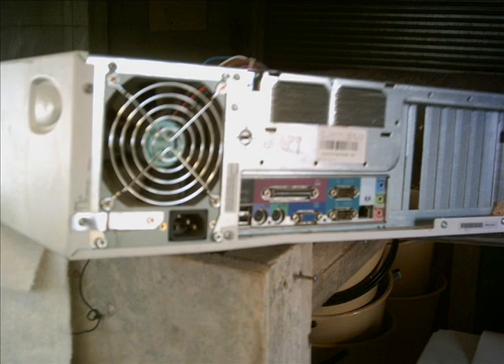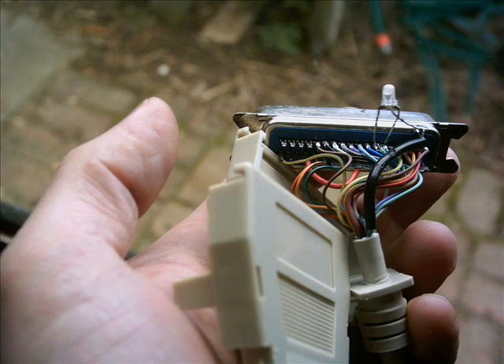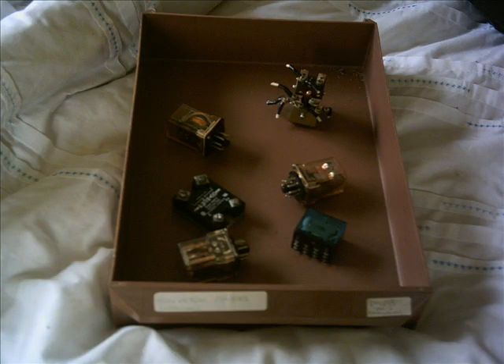Provided you have the two other necessary components, you can control your house — sky's the limit. There are eight pinouts on this one, and I'm just using one pinout. You've got to have a cable to plug into that port. I've taken the case off and you can see the wires exposed. There's also an LED wired to the end, and if you're able to use the software on your computer to send pin on or pin off to the end of this cable, you need to plug it into one of these relays.